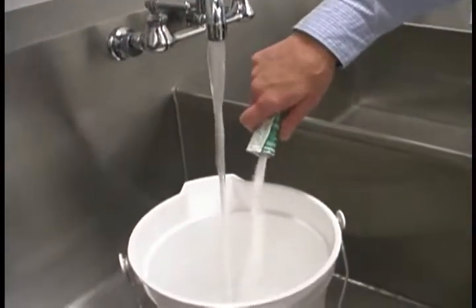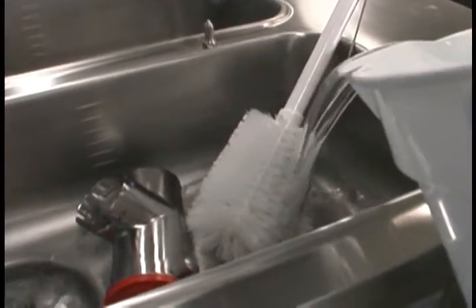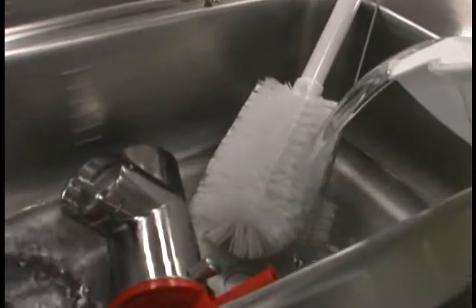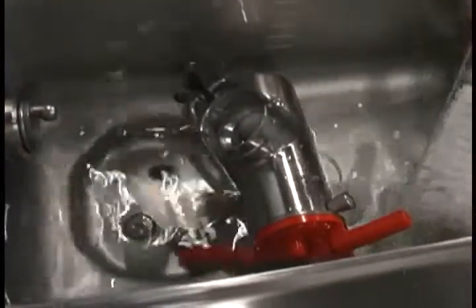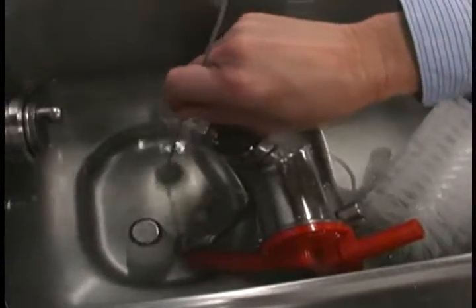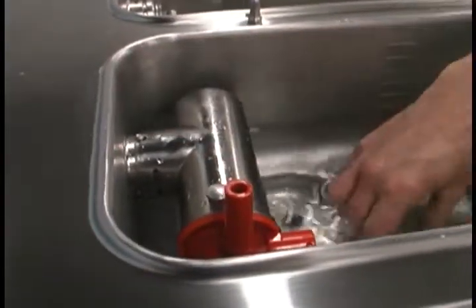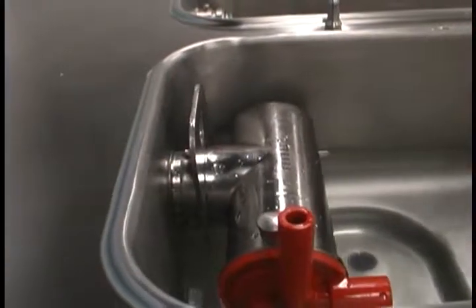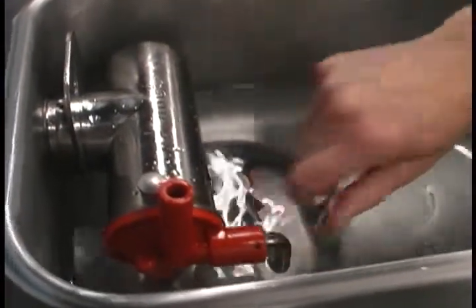To sanitize, prepare two gallons of an approved sanitizing solution and warm water. Pour the sanitizing solution over all the parts in the bottom of the mix hopper and allow it to flow into the freezing cylinder. Make sure your hands are clean and then, while the solution is flowing into the freezing cylinder, brush clean the mix level sensing probe, the mix hopper, the mix inlet hole, the air mix pump, the pump clip, the mix feed tube, and the cotter pin. Install the pump assembly at the rear of the mix hopper. To position the pump on the drive hub, align the drive hole in the piston with the drive crank of the drive shaft. Secure the pump in place by slipping the pump clip over the collar of the pump into the grooves in the collar. Install the pump end of the mix feed tube and secure with the cotter pin.